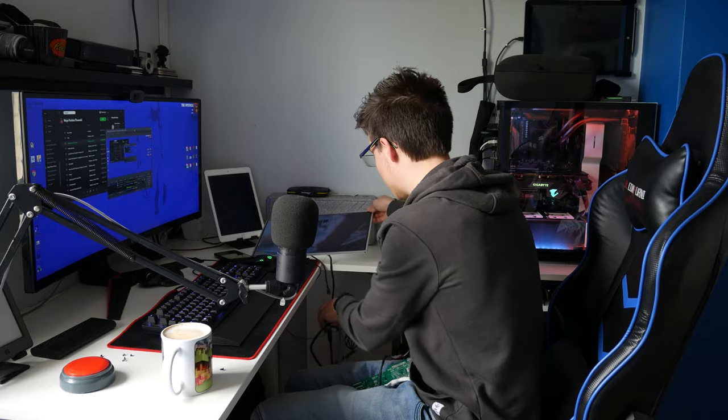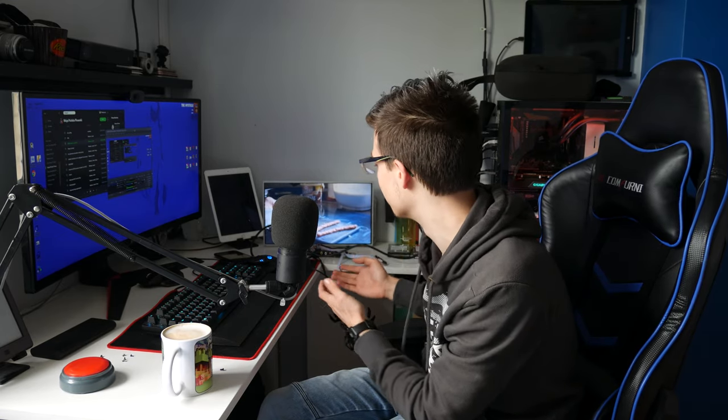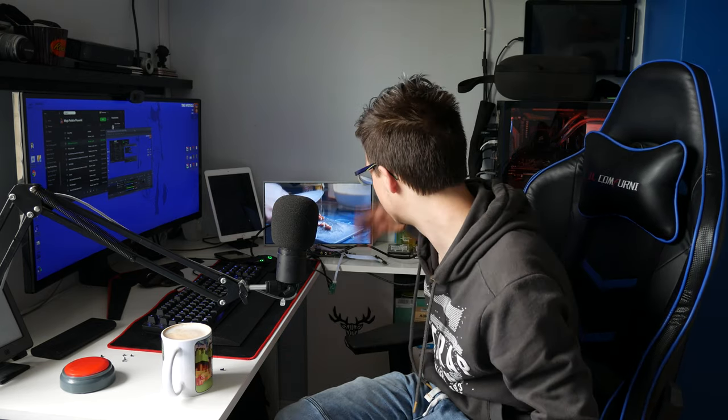I actually have a second controller board — I found these things so incredibly useful back in the day that I got two. I could technically grab this second screen and have two right next to each other. And that's for the price of however much you pay for the controller board, because the screen you can probably get for free. This could actually be better than a full monitor because it's portable — throw it in a bag, take it anywhere. It needs 12 volts, and you can actually find LVDS boards that you can plug straight into a USB-C power bank.